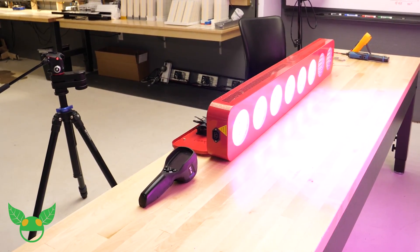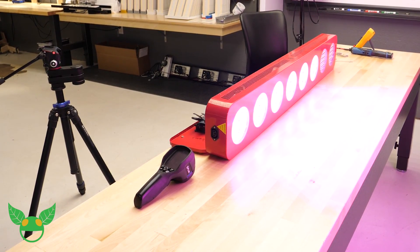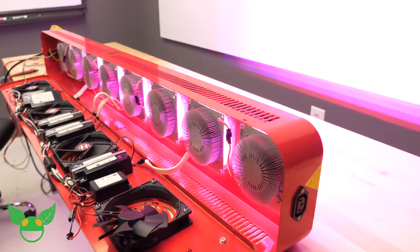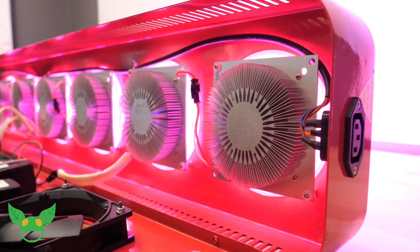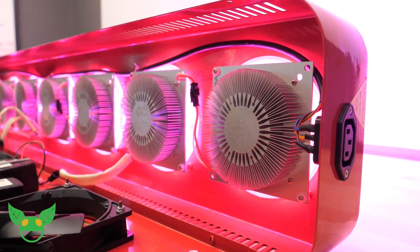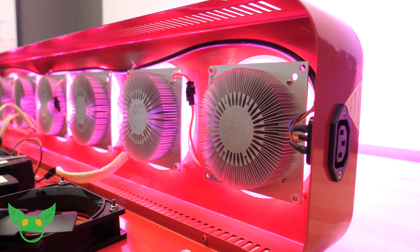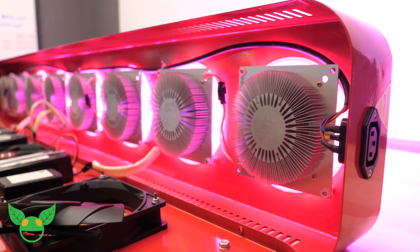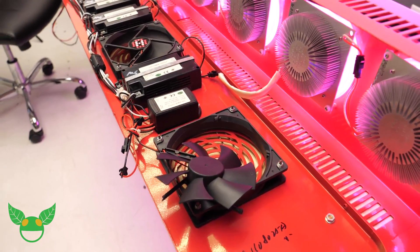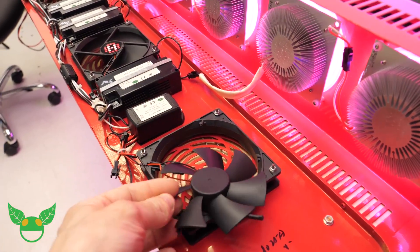You can hack just about any grow light on the market because a grow light is just a couple of different component parts — some LEDs on a heat sink with a driver. Some have fans, some don't. One of the hallmarks of an import LED is they use very small, almost wafer-thin heat sinks. Aluminum is pretty expensive and heavy, and the more of it you can reduce, the cheaper and more affordable the light can be. They combat these small aluminum heat sinks by using active cooling fans. This is a brand new light I just opened up to figure out why it was making so much noise, and somehow the fan just kind of broke off.